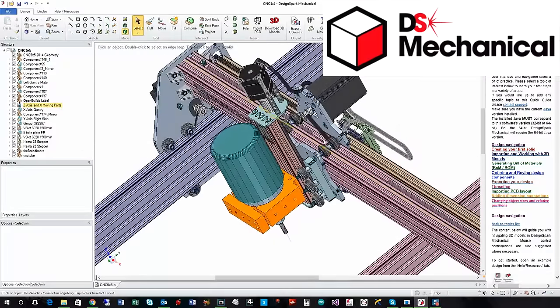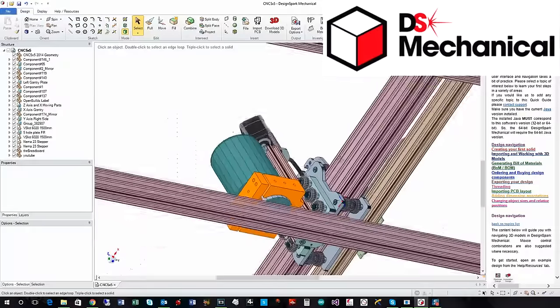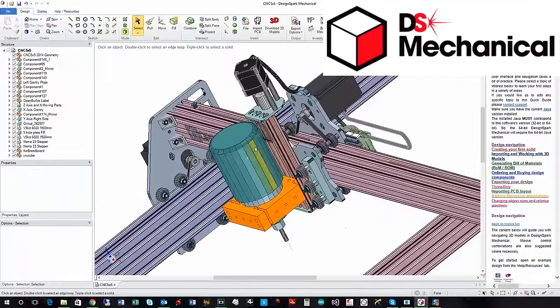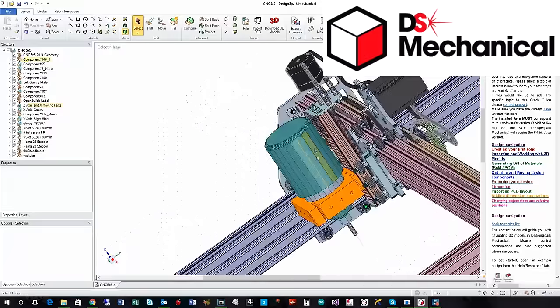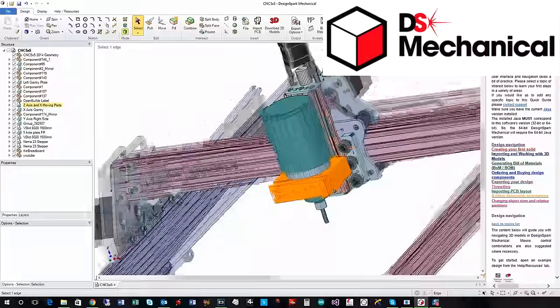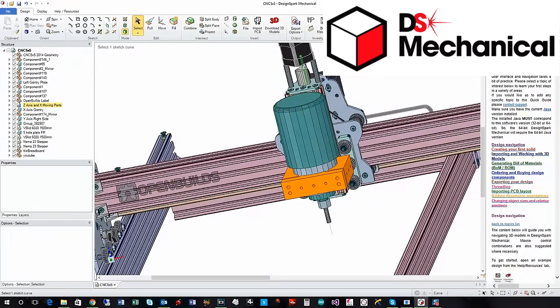You can see that there are only four wheels on the top and four wheels on the bottom. On the front here we've got the motor mount with the motor in it, and we have another shorter extrusion — about 12 inches long on my actual build — that's driven by an acme screw at the back. This drives the extrusion up and down as the stepper motor turns the acme screw, and with it the motor.